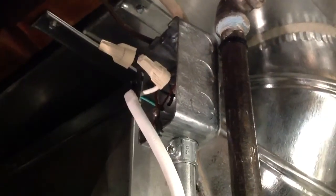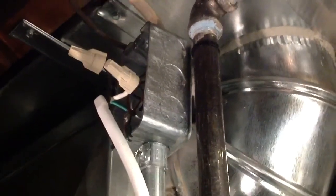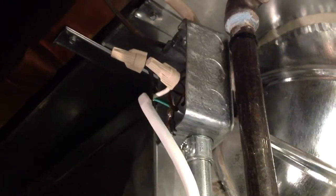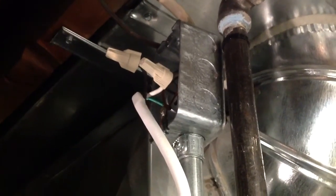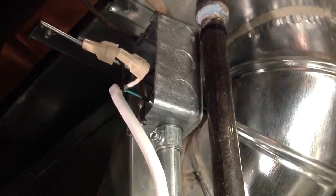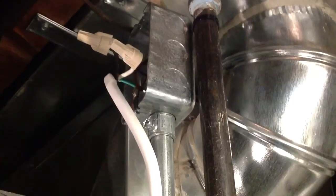What I really wanted to show you was what a junction box looks like. You can get them at any hardware store, and every time you make a wire splice in your utility wiring you need to use one of these metal enclosures. The intent is that if there's any sparking that should occur at that splice, the box contains it. Use wire nuts — those you screw over the twist splices you make inside — then tuck everything in there making sure nothing will short out, and clamp the metal plate on top. That's it.